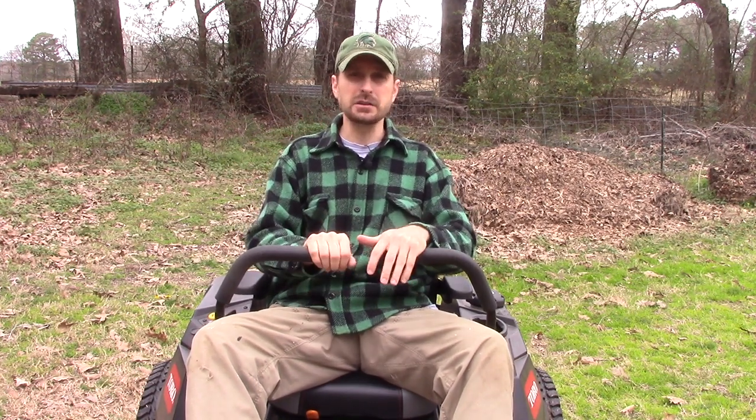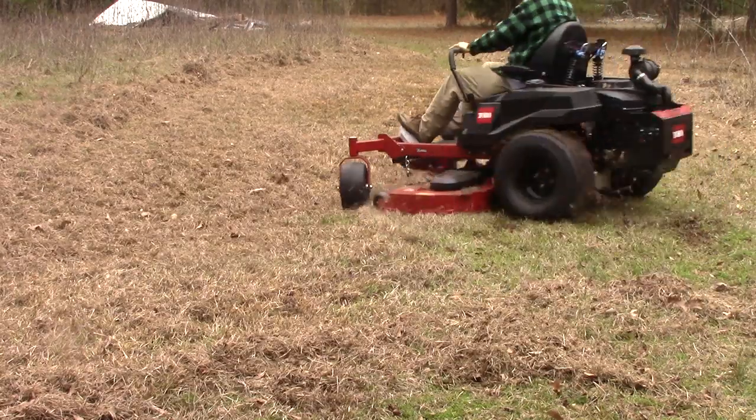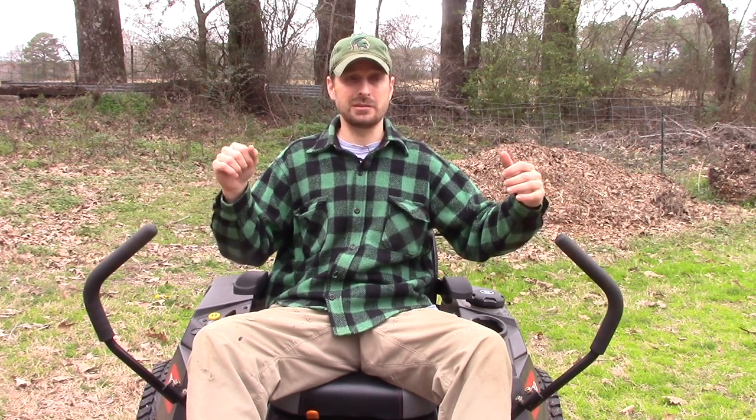They put their commercial dampeners on the ZT 2800 transmissions. So there's no herky-jerky movement when you're changing direction or turning. I didn't find any of that — it was incredibly smooth. Things are a little stiff, which might be because of the dampeners, and much more stiff than other mowers I've used. But in my opinion that's great, because I didn't get any of that jerking motion. When you pull back, push forward, or go side to side, it's just very smooth in its transition between those different movements.